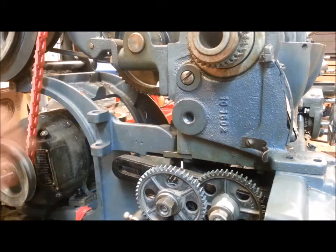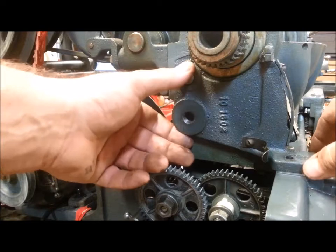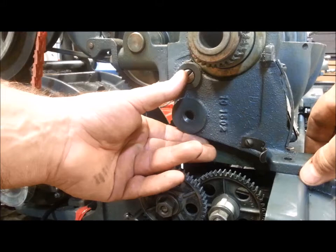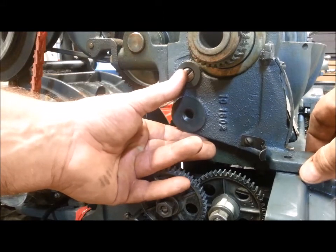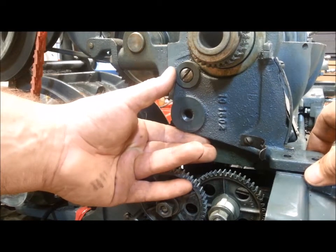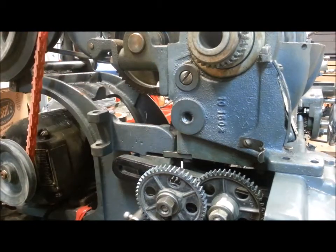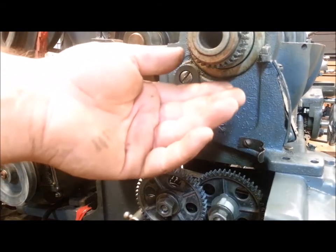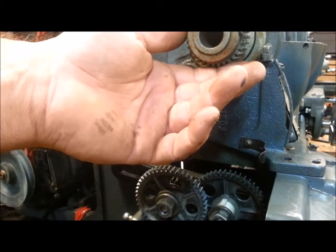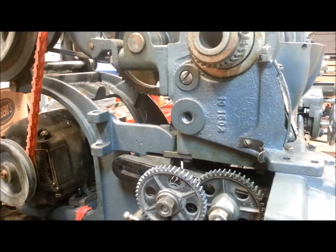Now here's my problem: I can't tighten and access this screw when the tumblers are on here. So I'm going to have to raise this up some measured amount by creating a shim for this part. Maybe we'll start out with about ten thousandths in shims and put it back together and see what our lash looks like between the tumbler gear and the main shaft pinion — the spindle pinion. So we'll get busy on that.